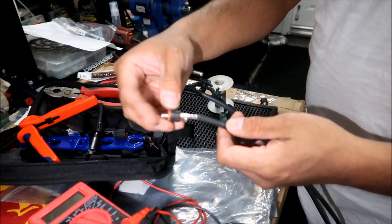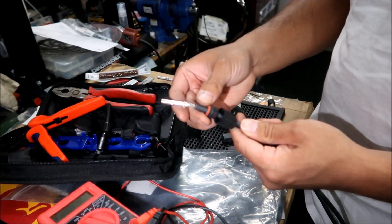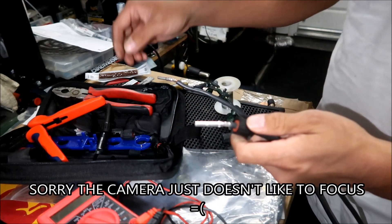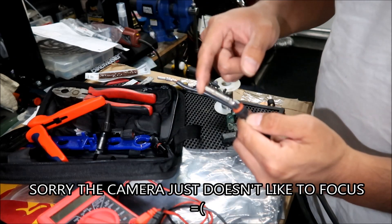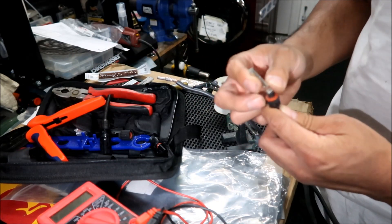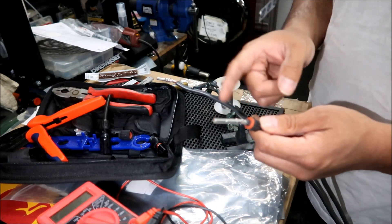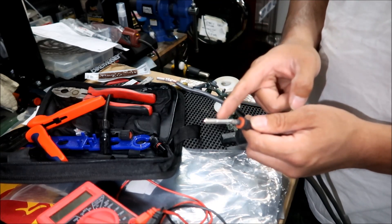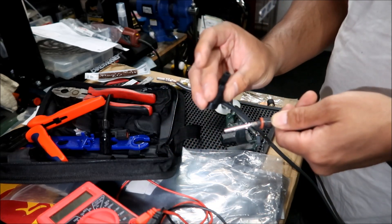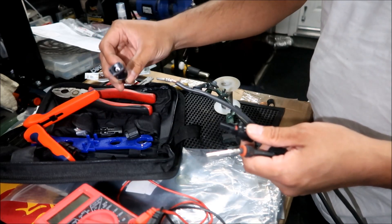It's supposed to go like this. Put the rubber seal and the plastic piece that goes over the rubber in. Now — this is the male housing, alright? The outside is the male but the inside is the female. So we want to get the male housing on, and then shove the pin assembly in there. If you get mixed up, just look at the pre-made reference connector included in the kit. So there's a metal connector socket in there, and you're going to push the pin on there and it'll just click in.